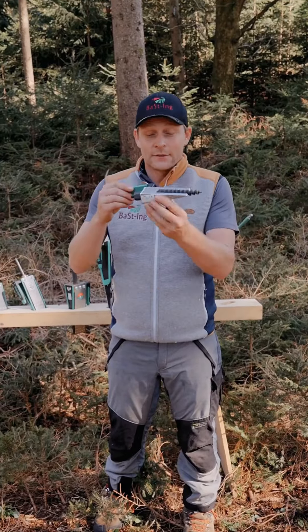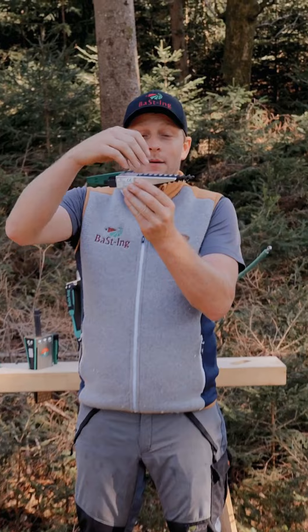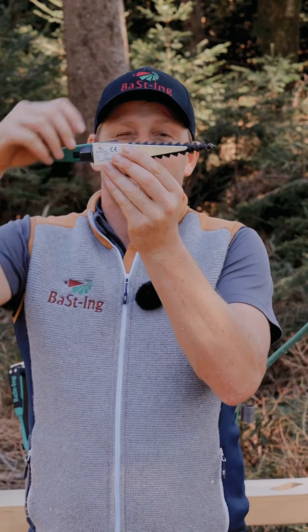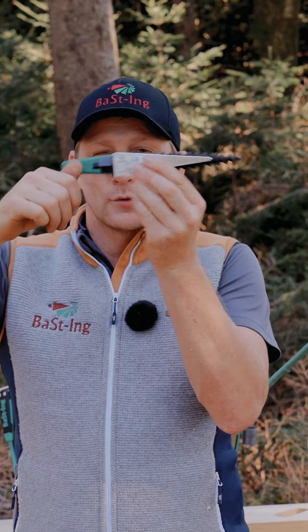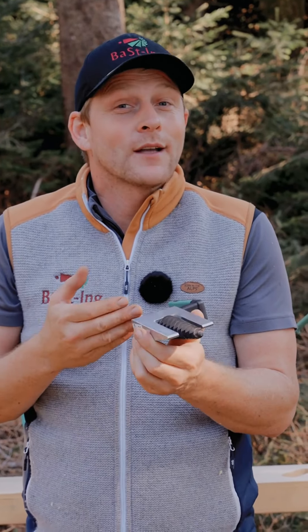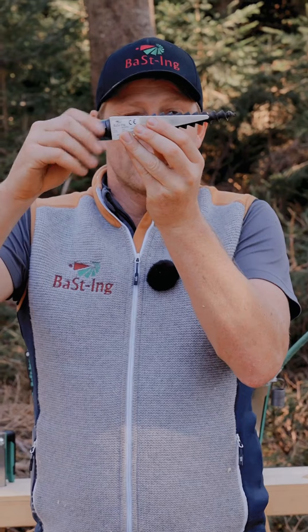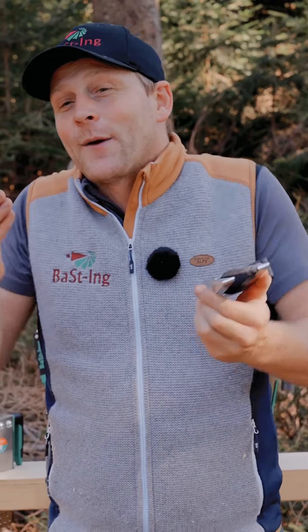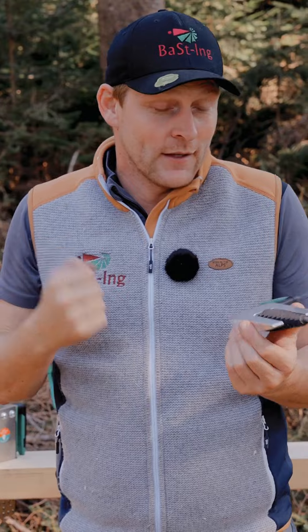It's called a spindle wedge because it pushes the wedge in. The thread holds in the wood and pushes the wedge forward. The lifting force of such a wedge cannot be specified because it depends on the type of wood. If it is spruce wood or poplar wood, then the wood breaks between the grains. With beech and oak, it exerts more pressure because the wood simply lifts more.